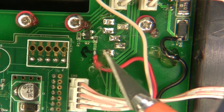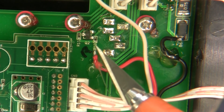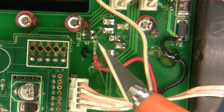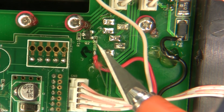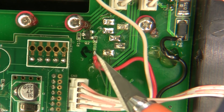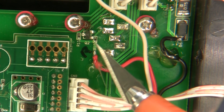I did that, and it worked great — no problem. So if anybody else out there is a little afraid of soldering to that tiny little area on R10, that might work a little bit better. Just scrape that off really nice and clean — you have to be careful not to mess with the trace — put some solder on there and solder it on. Much easier than getting to this side of R10 directly.